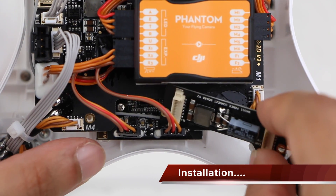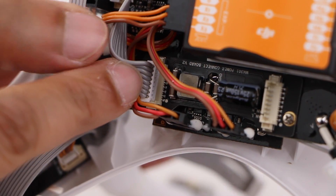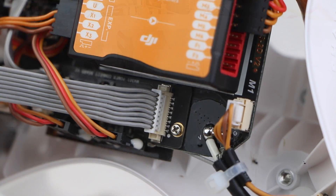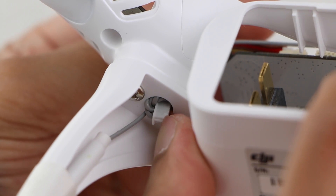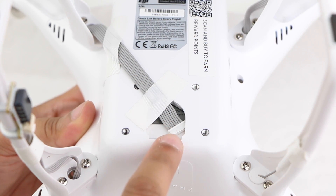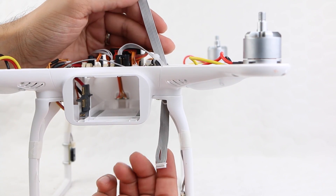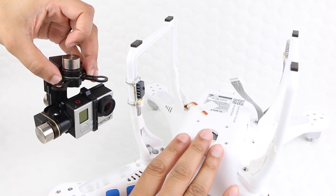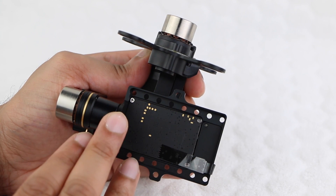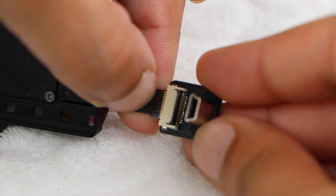It's a good idea to install the anti-interference board alongside the gimbal. If you haven't done so already, I'll leave links at the end of this video and in the description below on how to safely install the board inside the craft itself, which also involves feeding the gimbal cable through an alternative hole in the belly of the craft. If your board isn't installed, you will find your gimbal cable coming out of an alternate hole in the landing gear, although the installation of the gimbal itself is the same nonetheless. Before mounting the gimbal to the craft, it's a good idea to prepare the gimbal by removing the securing tape to free the side ribbon cable and attaching the USB adapter.